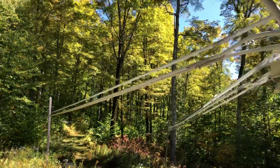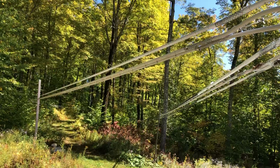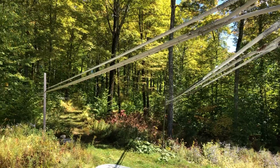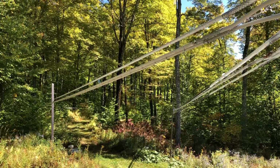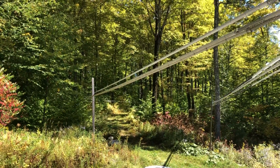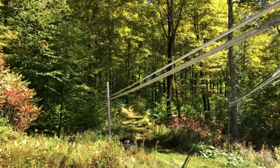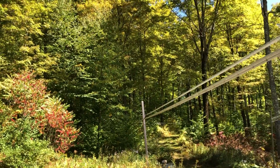Over here, the top line is 1.25 inches. That goes 3,000 feet and it goes to 500 taps. Could you warrant a wet-dry system on that? Probably, I suppose you could. But honestly, the little bit of vacuum loss that I've seen is not from this 1.25 inches. It's from the 3/4 lines at the end. They are kind of flat, hovering between 1 and 1.5% grade, and I've had a few issues with them freezing. I probably need to switch those from 3/4 to 1 inch because it's a little bit flat there. But that's a whole other issue.